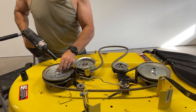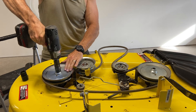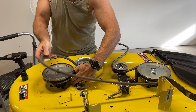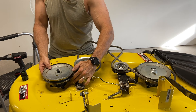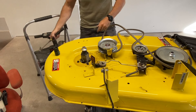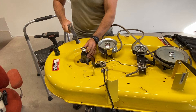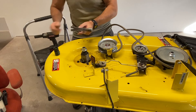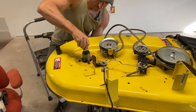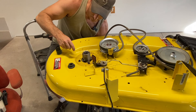First I got to take this nut off. Take this belt off. Now here's your blade spindle. I have to take this jack shaft, which is connected right to my blade, out of the blade spindle. Put your nut back on there so you don't mess the threads up, and use a hammer and tap on it. Make sure the blade is not sitting on something down there - it's got to be able to pop right out. There's your blade.